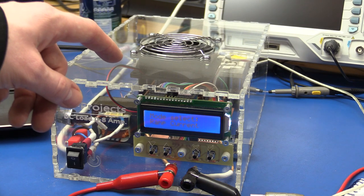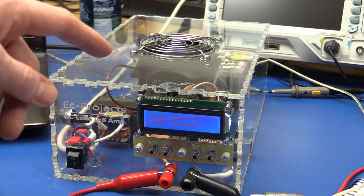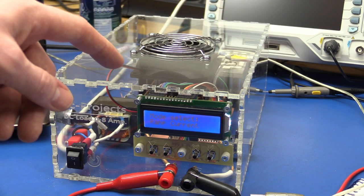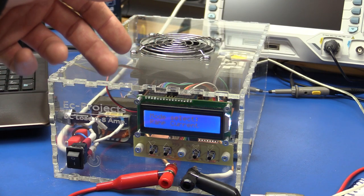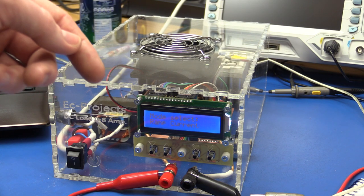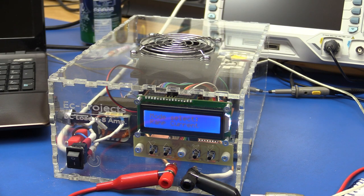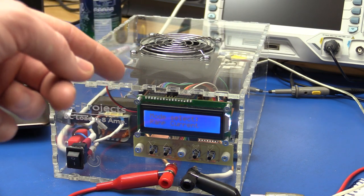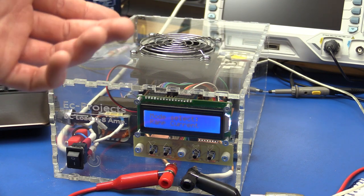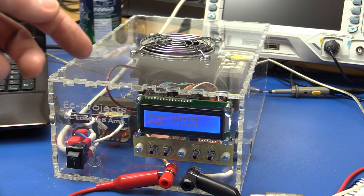I have also made changes to how the fan is controlled. As I said earlier, I'm driving it with a PWM signal. Before, that signal was 300 Hz. And you could hear a 300 Hz hum when the fan was spinning, except at full speed. So even if the fan was just slightly spinning, it would still have this annoying 300 Hz hum. So now I upped the frequency to 30 kHz. I also tried that before, but that resulted in the fan wouldn't start up until the PWM signal reached 85% duty cycle, or something like that.